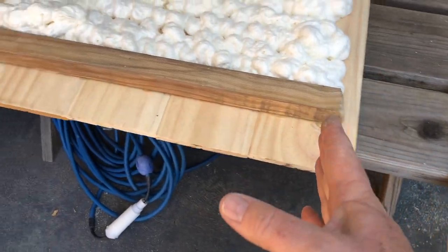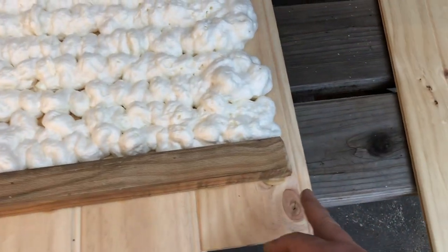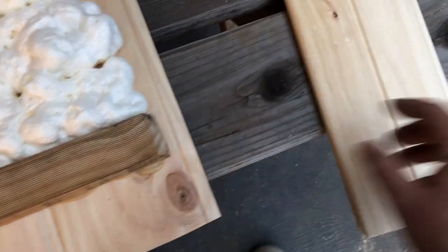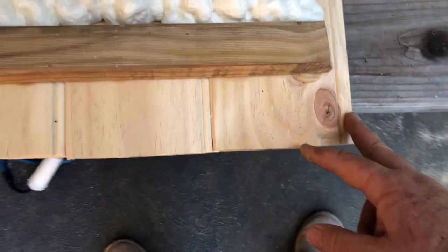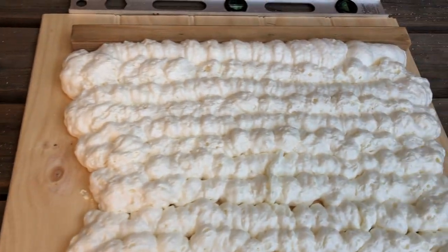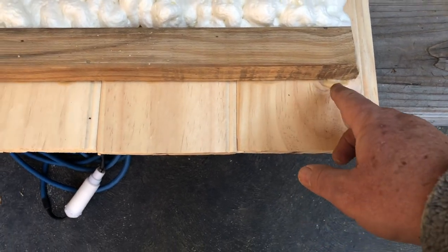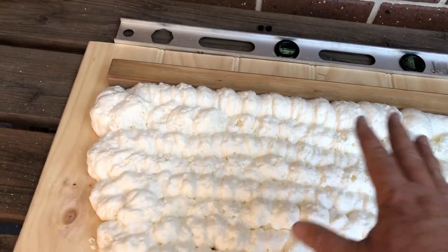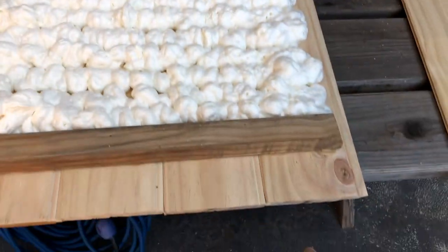I've chopped all the panels down to the correct height and squared them all up at the top. Cut a couple of beams — you've got to work out the width. Mine was 61 centimetres, so I cut these at 59, leaving just a centimetre each end. When I'm trimming this up — that's the tongue and groove on that edge — I'm going to trim that tongue off because it's very thin and could quite likely be broken. Because this is just a temporary door, I haven't put any nails or screws into the cross beams — I've just used construction adhesive, and I've also used insulating foam because I want this door insulated. I'll put links in the description for the glue and the spray-on foam.